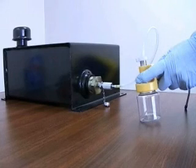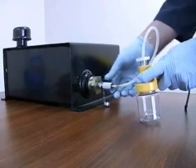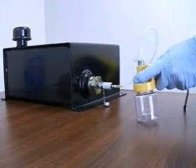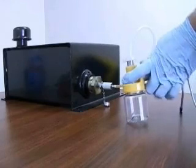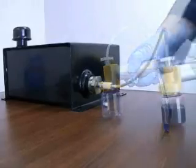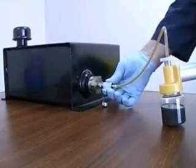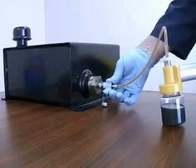Draw a purge sample to clear the static oil in the LT tube. The amount of purge oil is usually less than 2 ounces or 60 milliliters for an LT 24 inch. Thread the probe fully on the valve, pull the vacuum plunger several times to start the flow, and avoid over-plunging which may collapse the bottle. When 2 ounces of oil has been collected, unthread the probe approximately 2 turns to stop the flow. This will keep the connection sealed.